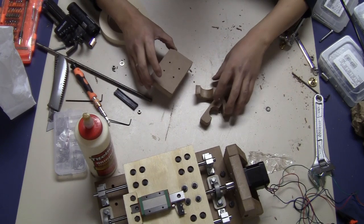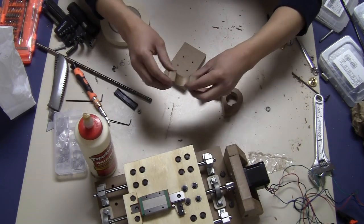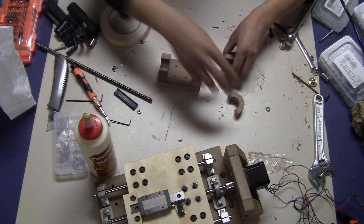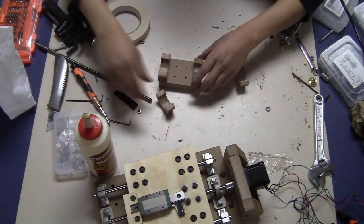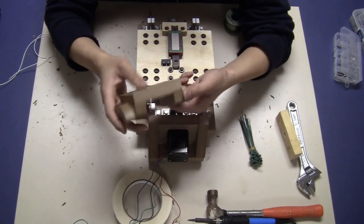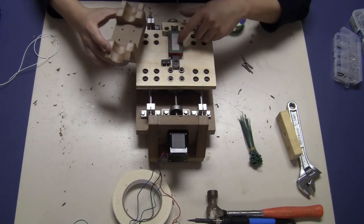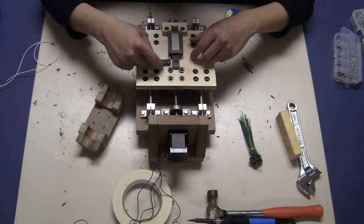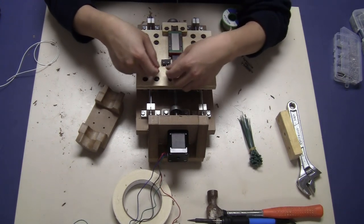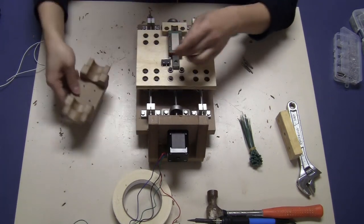For the torch holder I have this piece to be fixed on here, but I'll do it later. First I want to glue the pieces together using wood glue. The torch holder is glued together and really sturdy. Before installing this on the bearing block, I'm going to solder two wires to the pins of the limit switch while I still have space — once it's installed there's very limited space.